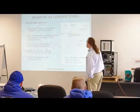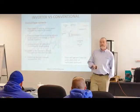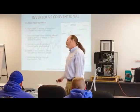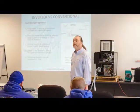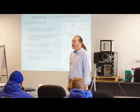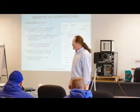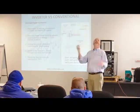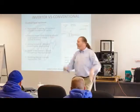Massive sheet metal ducting absorbs large quantities of energy — in this case, heat — and that's worse when the ducts are in the attic. The ducts are always in the attic in New York and New Jersey. In Vegas or the Carolinas, ducts can literally be in the ground because they build on slab. But usually, if not always, the ducts are in attics — or like in this case, above a drop ceiling. It's not conditioned; it gets hot as heck up there.